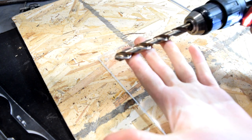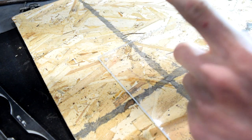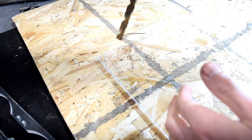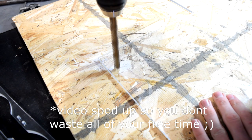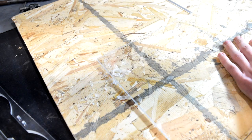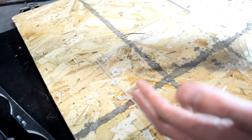If you're using a larger drill bit — like this 11.8mm used for G1/4 — you do want to try to make this a little bit smoother and nicer for acrylic. It's going to take a little bit longer to cut the hole, but as you can see, it'll really help prevent the hole from breaking out. And voila — no breakout. Clearly it's melting the plastic more than it is cutting it, but with a little bit of cleanup, this will be ready for tapping.